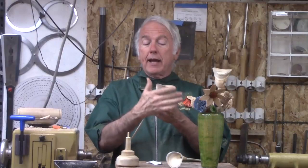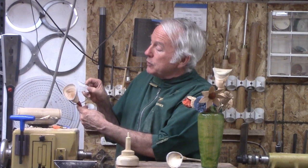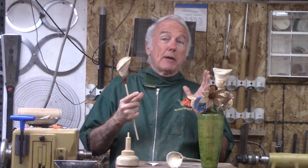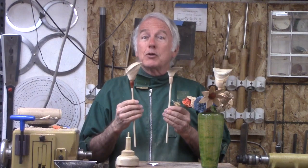The style of flower is this one — it is turned from a round of wood. The one thing that helped a lot was to make myself a little template, because you have to lay it out to try and get exactly how much of the side of the wood versus the wood versus having a tenon down at the bottom. That is mighty tough to visualize in 3D space. It is versatile — here's another style from the same piece of wood that looks very different just from the way it was cut. So for this video, let's turn this flower.